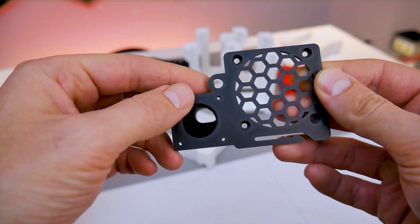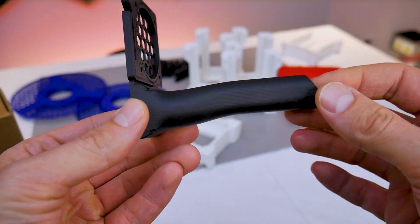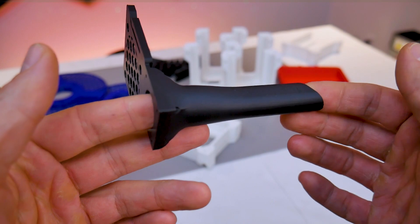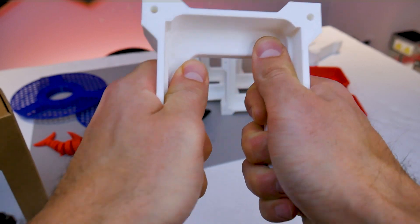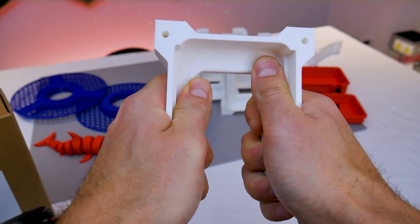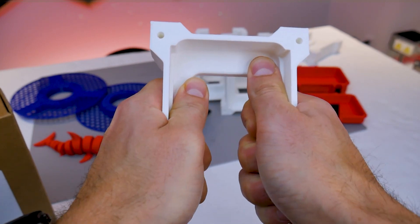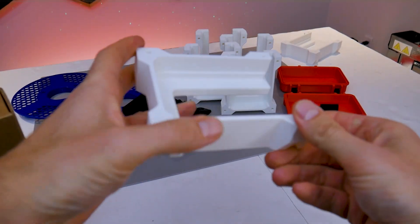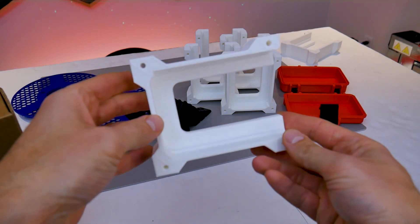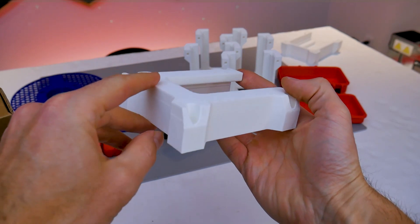I just think my profile for the larger nozzle needed a little more tweaking. Prints from various other machines with the more common 0.4mm nozzles were beautiful and extremely consistent. I attempted to break a few of these parts by hand and separate the layers. On thin walled parts this was definitely possible, as it would have been with any other PLA, but I reprinted a few at slightly higher print temperatures — for example 215°C — and found a noticeable improvement in layer adhesion. Therefore if you need a little extra strength, consider bumping up your nozzle temperature slightly.